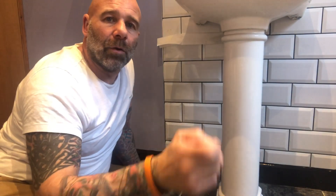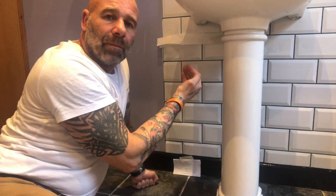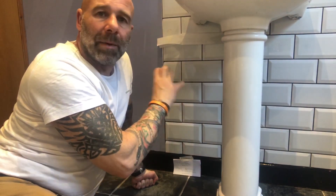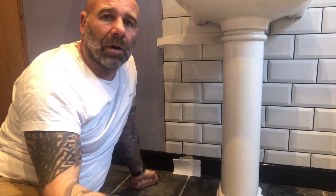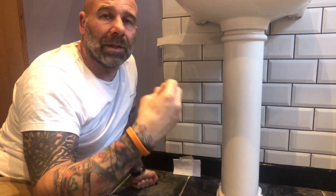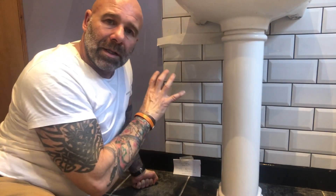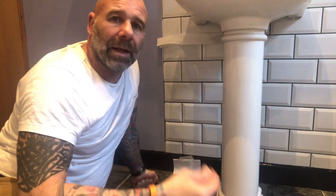And that's why other systems were invented, which allow water vapour to travel up the wall, evaporate out, and the salts that come out will be neutralised by the backing plaster. Systems like Renderlight, renders with an additive — that does work. Dry Zone plaster, there are quite a few. And also there's the plasterboard system that Safeguard brought up — we call it their express system.